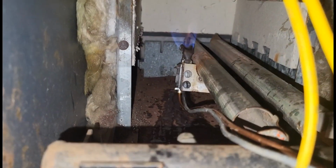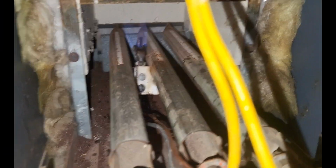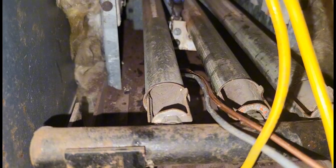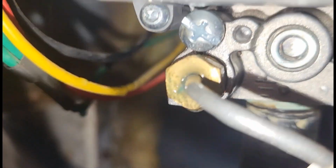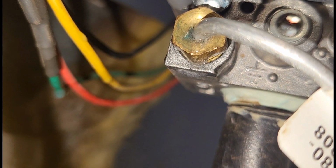But guys, I need my headlight. I gotta look underneath the burners. I wanna see if there's any bubbles on the other end of that pilot line. Hold on, I'll be right back. All right, guys. The other end of that pilot line near the pilot assembly is good, no bubbles. And I just hit this with some soap bubbles again, and no bubbles. You see that?